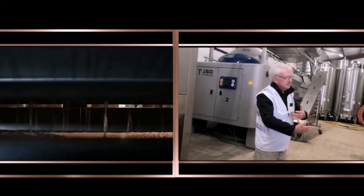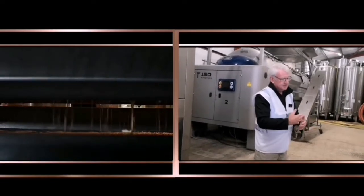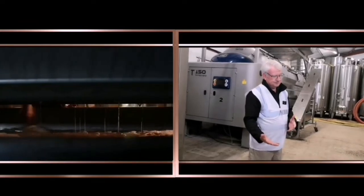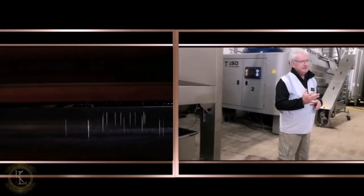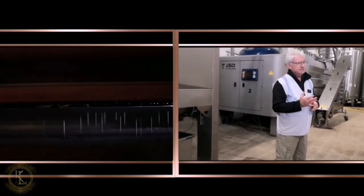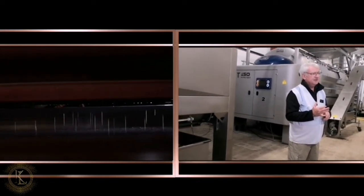So, we start the pressing motion, the balloon inflates, presses the grapes against the side of the drum, it also rotates, and then it takes the pressure off and goes back on again, very gently, and starts rotating. Eventually it will crack the skins and the juice will start to flow. We collect the juice in these receivers like that, underneath.